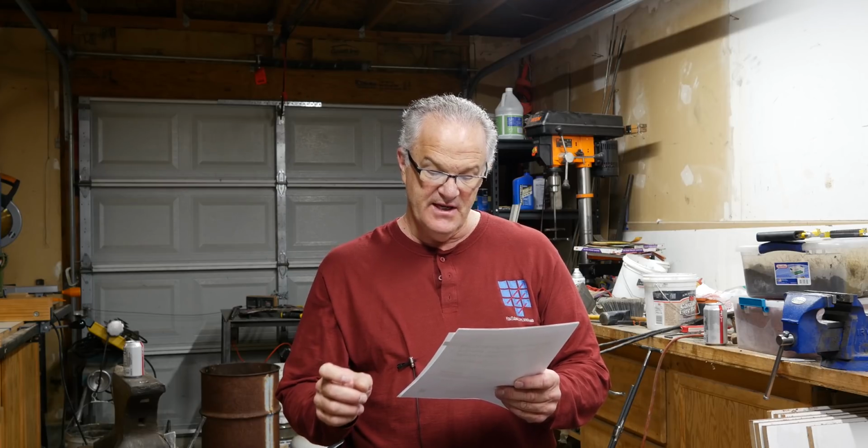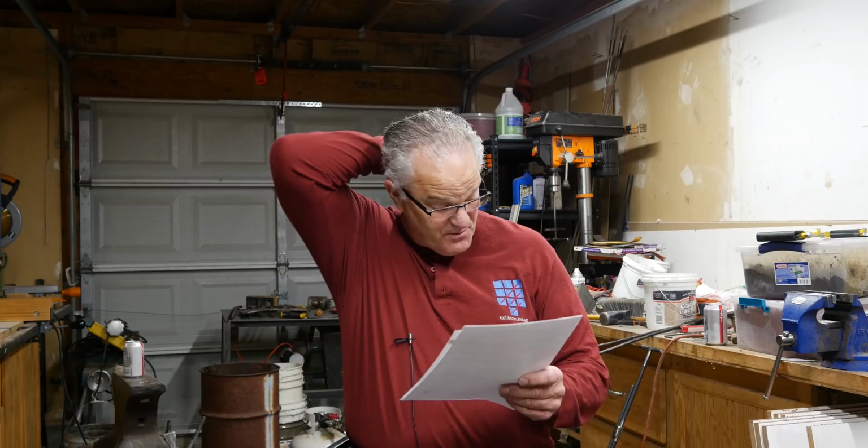All right, rule number 2. Avoid turbulent entrainment of the surface film on the liquid. This is a requirement that the liquid metal front, the meniscus, should not go too fast. Maximum meniscus velocity is approximately 0.5 meters per second for most liquid metals. 0.5 meters per second. I'm going to talk about that here.